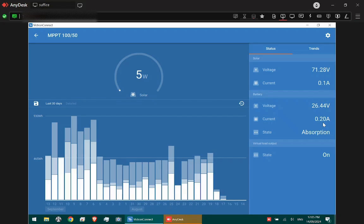It's pretty poor. Nevertheless, this will eventually go into float, but you can see that the controller or something is just not happy. As the watts go up, the voltage goes down. You can see as it moves up to where it wants, and then it shoots back down again, and it's just all over the place. This is where I added the second panel, the unmatched panel that Dave provided.